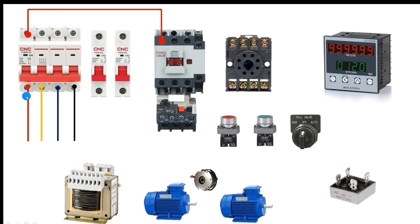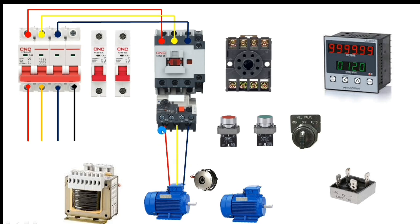For power wiring, first connect R, Y, B, and neutral in the power MCB. R phase connects to the contactor L1 terminal, Y to L2, and B to L3. Since both motors run with this starter, first connect RYB to the main motor, and also loop this RYB connection to the winder motor. When the starter operates, both motors run at the same time.